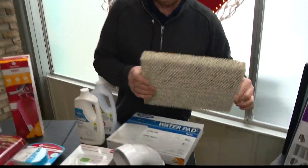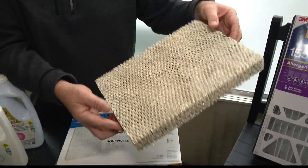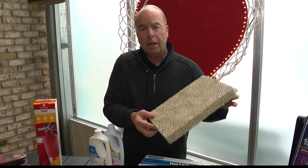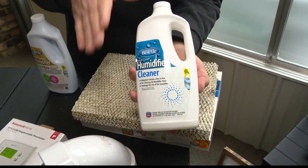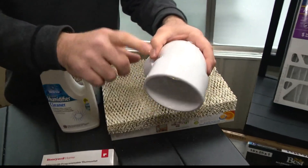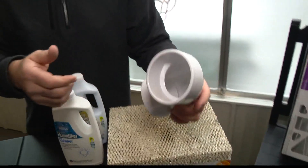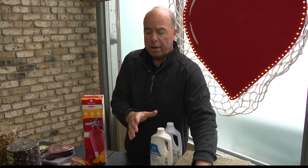Do you have a humidifier? Do you even know if you have a humidifier on your furnace? If you do, there's a pad in it that could be completely full of lime and calcium and not really doing much. You can clean it — you can actually get a humidifier cleaner. This is also for tabletop and console humidifiers around the house because the air is getting so dry. Some efficient furnaces have a PVC around the side of the house — that could be the intake. Make sure that stays clear so it doesn't get clogged.